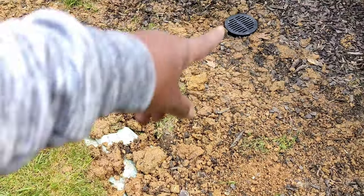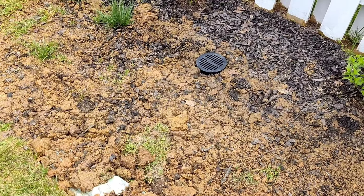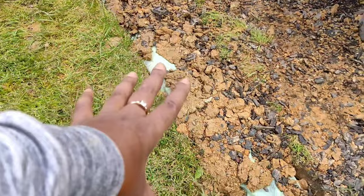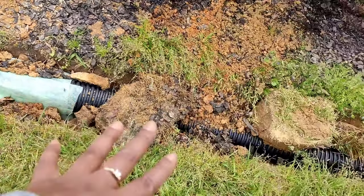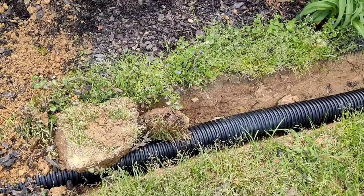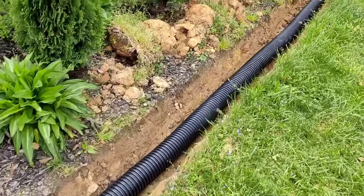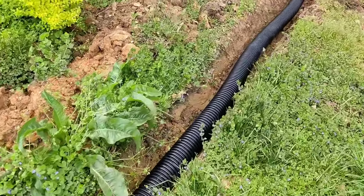The perforated pipe runs all the way down to about here, and I attached a Y in here, so I did put in a drainage catch basin that is going to catch all of the water that puddles in this area really bad, and then it'll run and flow and attach nicely into this drainage system. I put in screws to secure all of that. The French drain portion stops here — from here all I did was attach solid corrugated pipe with no slits or holes for water to seep in. This part stays pretty dry — when it rains it just dries out perfectly fine. This is a pretty steep downward slope from here on out, so all I'm going to do is backfill.